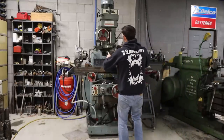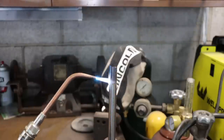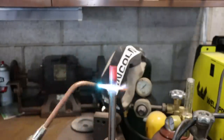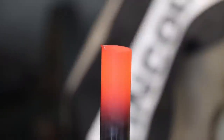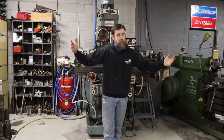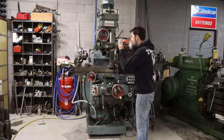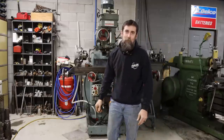All right, so that's it this week. Drawbar turned out really nice. I did actually make a drawbar out of that hardened Thompson shaft. I just annealed both ends. I had to make an extra one because some of these holders, even though they're BT-40 and shorter, there's a few of them that I have that have a 5/8-11 thread in them, so they're mismatched. But now I have a way to hold any of the tool holders that I have in this spindle, so that's nice.